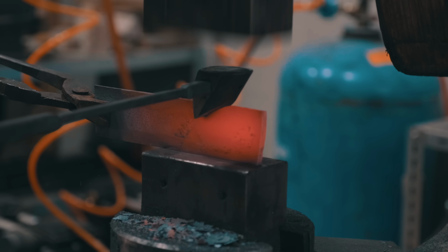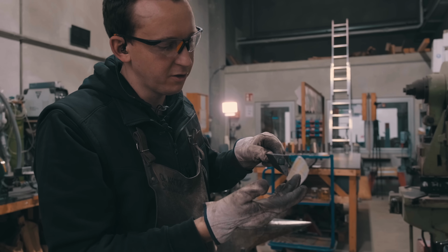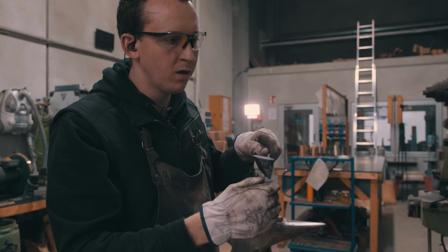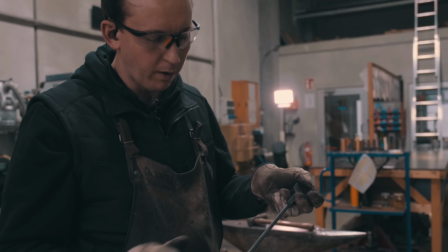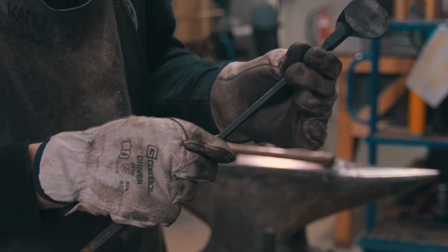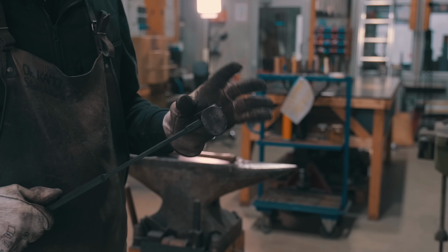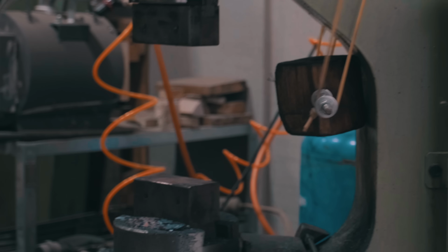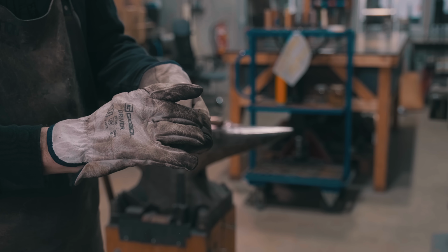Yeah, it pretty much acts like a chisel, and you can cut a slot in the rectangular piece with one side still being true to the knife overall and one side being angled. With tools like that, you always want to make sure it doesn't vibrate into the holding hand, so that section is thin intentionally because it gives the tool some flex and reduces the vibration of the power hammer in the hand. Yeah, and you usually don't weld those pieces because welds would break. You slot them in or rivet them or something like that. Always connections that are kind of loose.